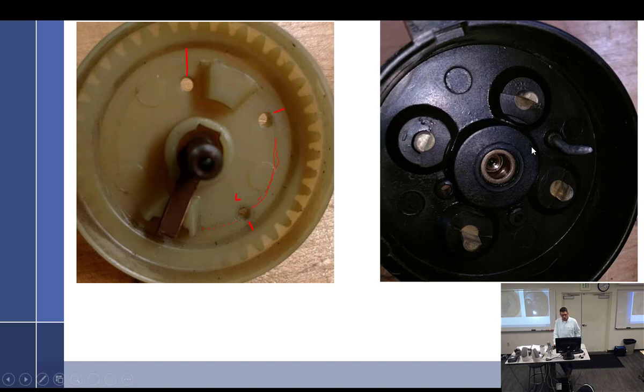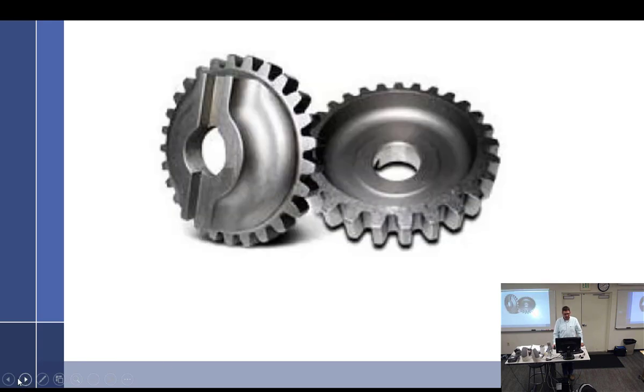So I have a rule myself when I do magnetos. Put the pin in, set it where it's supposed to go, walk up to the engine, put it on the engine, and take the pin out. That fast. Do not leave the pin in there. All you have to do is turn the mag a little bit this way, or somebody wants to help you with the prop, and that's what you get. And if it's an airworthy mag, you get to rebuild the whole mag.